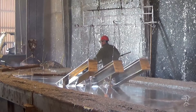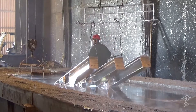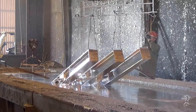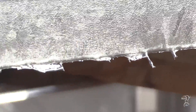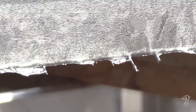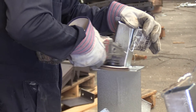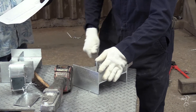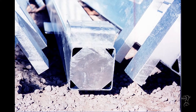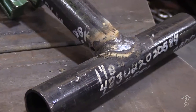Steel is withdrawn at an angle to allow excess molten zinc to flow back into the galvanizing bath. Where any molten zinc is unable to fully drain away from the part, it eventually cools and hardens on the surface. This can lead to zinc buildup such as runs, drips, or spikes. The galvanizer is responsible for minimizing zinc buildup and for filing down any sharp drips or spikes that affect the material's intended use or safety. However, properly cropping corners and optimizing vent drain hole placement will minimize the potential for trapped zinc.